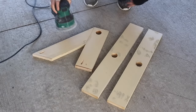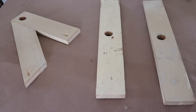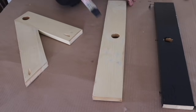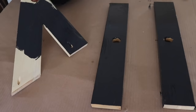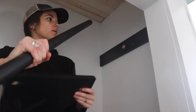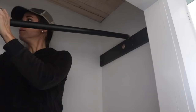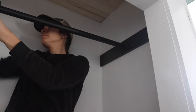The pieces of the old closet rod that I took out I decided to repurpose by filling the blemishes with wood putty, then sanding when that was dry, and finishing with two coats of my favorite black paint from Behr. Once this was done, they really looked a lot more modern. The Kreg holes that I drilled in that middle angle piece will allow me to support the center of the closet rod without an unsightly 1x4 showing across the front face of the closet. This shot cracks me up, because I'm 20 weeks pregnant and I'm getting myself into such a tight space in order to install this closet rod.